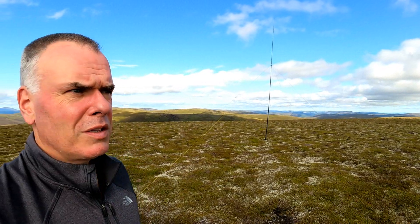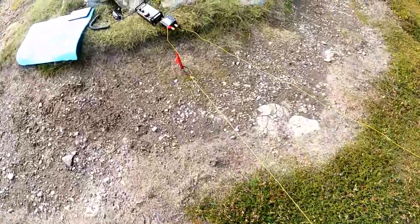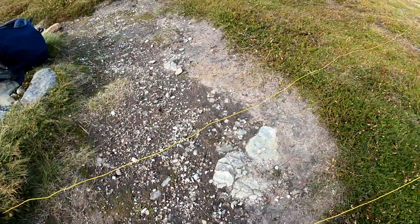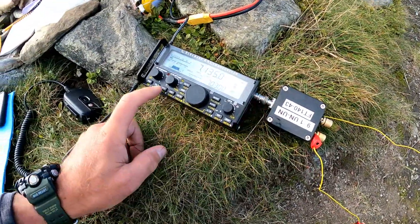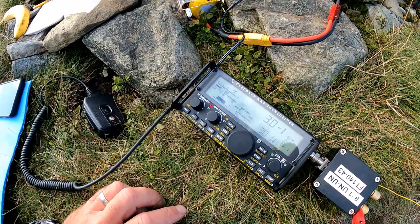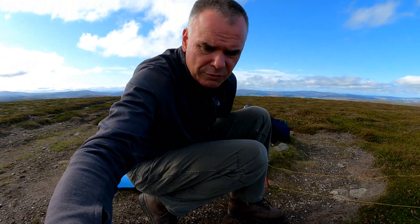That was a quick setup. We've got the mast up there, the W3 EDP antenna set up in inverted-V fashion. You can see I've got strain relief there, and that's the counterpoise wire heading back off into the bush. It's a 9:1 homebrew un-un connected straight to the radio — press the tune button and that's a perfect one-to-one match on a piece of wire that radio has never seen before.